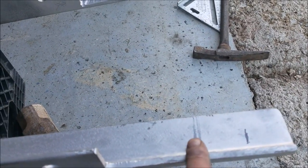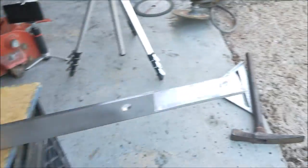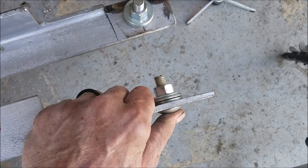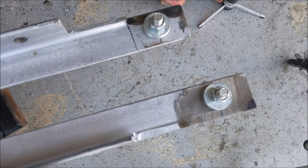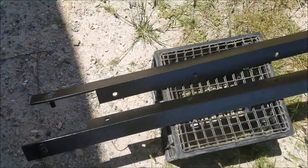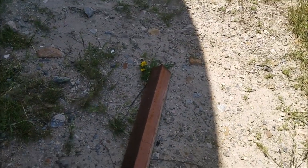Because I'm having angle iron go flat against this, I have to grind it down flush on both ends and both sides so I get a flat nose, so the angle will fit flat against this. I'm using carriage bolts up against the bed — got it in one of the ribs — but I don't want a bolt pushing up on the bed, so I'm going to put a couple of spot welds on each one to hold them in place. I had to drill a 5/8-inch hole versus a 9/16-inch hole. These are ready to go in with the carriage bolts welded on top. I'll paint them black when I'm done. For the other part of the bracket I'm going to use three-by-three by quarter-inch angle.